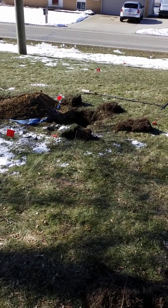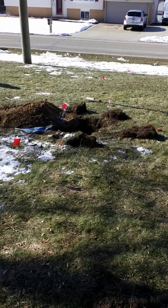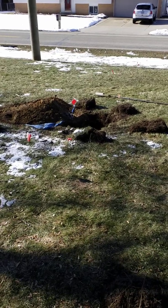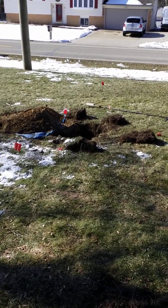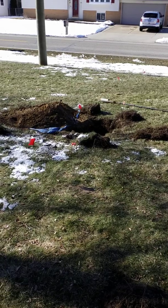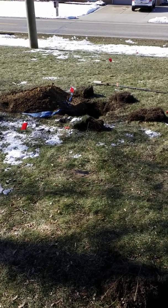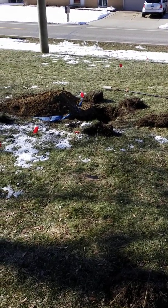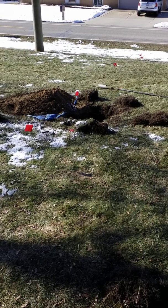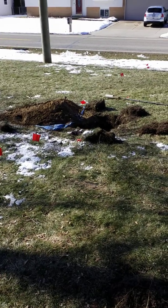And what would you normally push through a system on a daily basis? Well, on this one, it was designed to handle 200 gallons a day. Okay. The average household is sending out 60 to 75 gallons of sewage per person per day. Okay. So, in essence, two people living with water conservation may be able to work on this drain field successfully. However, if you had more people than that, it would probably be difficult. This field I would not expect to last very long. If you had two people using high amounts of water, again, I would expect it to have some difficulty. Okay.